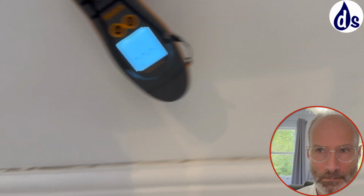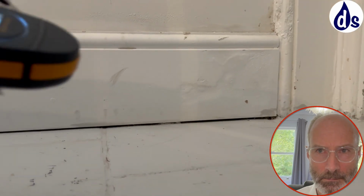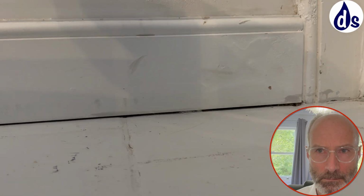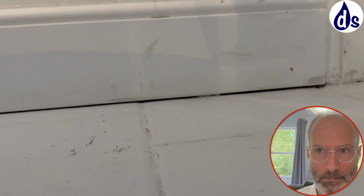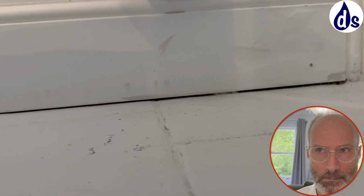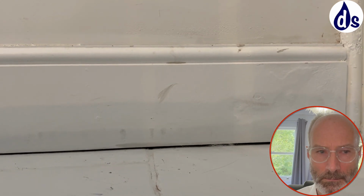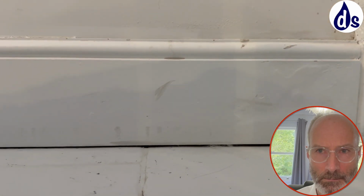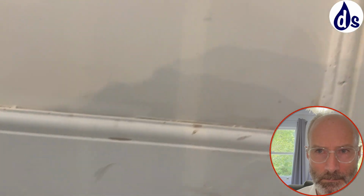Damp there, but dry there. So this is dampness above a solid floor that's going into the corner there. I mean, it wouldn't be rising damp anyway, just because the shape is wrong. Anyway, it's been damp proofed on the outside, but condensation will form on the solid floor and move up.